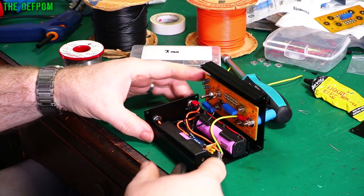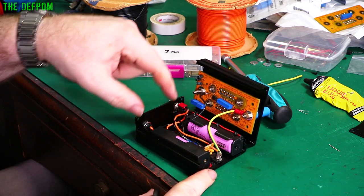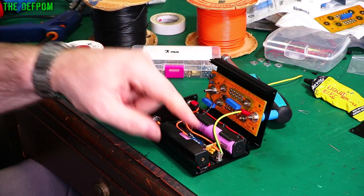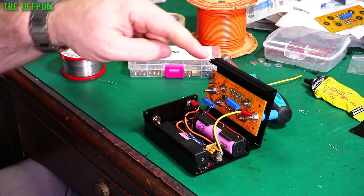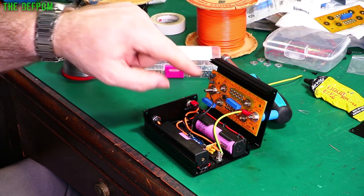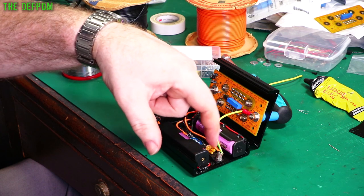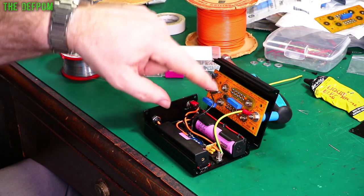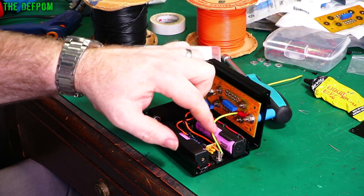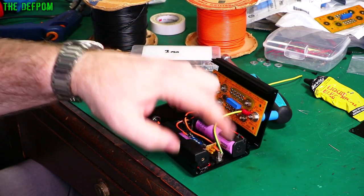This is coming along. I've got a voltage regulator in here now, which I almost forgot to do. The voltage regulator is off the switch — so it goes from the switch to the voltage regulator; it's a 5-volt regulator. I've got a couple of tantalum caps on there and that's going to run the power to the board. So: switch on, runs to the regulator with the tantalum smoothing caps, which then powers 5 volts to the main board. I've finally got to hook up the negative reference — the 0-volt rail to the regulator — and the power output from the regulator to this board.